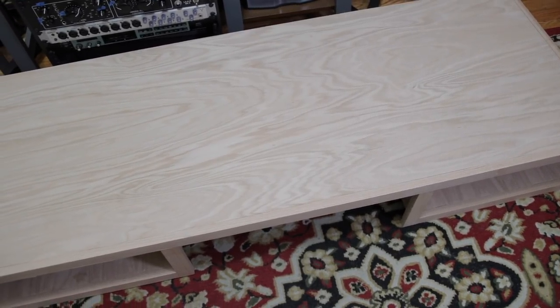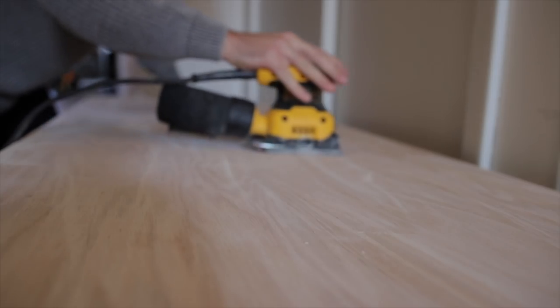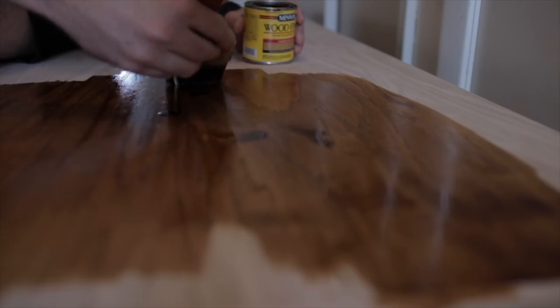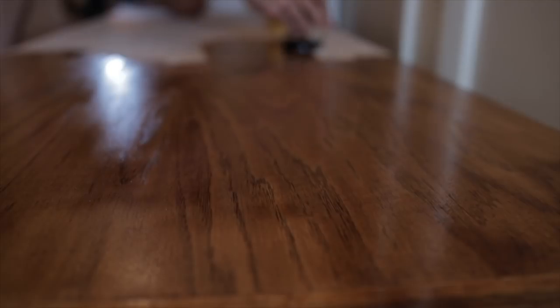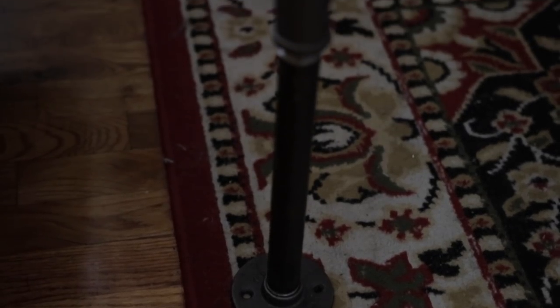My stepfather was generous enough to help me put the top of the desk together. We built the desk top using entirely oak plywood and then some one and a half inch oak pieces for the trim. The desk looked pretty cool natural and unfinished, but I decided to go with a light stain and a poly finish. This process took about two days, and I was very high off fumes because I did this in my apartment. Next, I went down to a local hardware store and got some three-quarter inch black plumbing pipe. The frame is pretty simple — four legs on each corner with a support bar running across the sides and the back. I fastened the legs to the desk using pipe flanges, and also used pipe flanges for the feet.